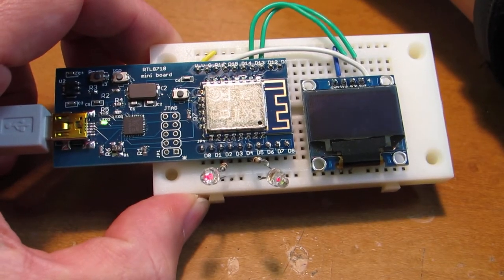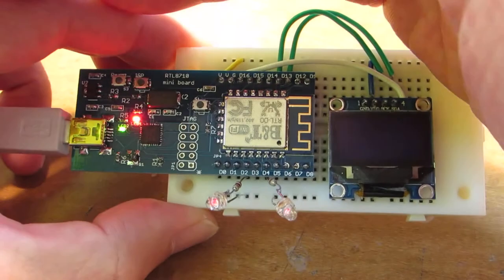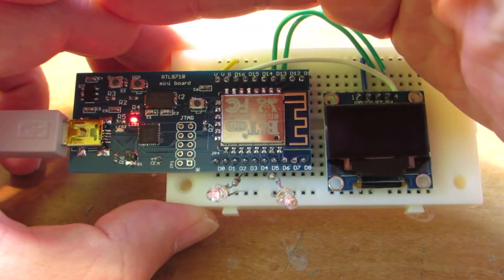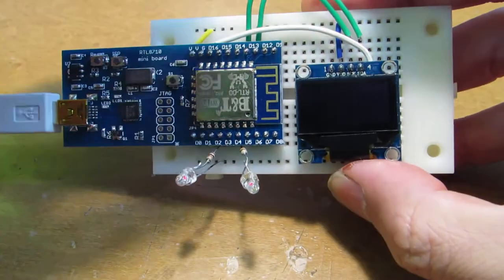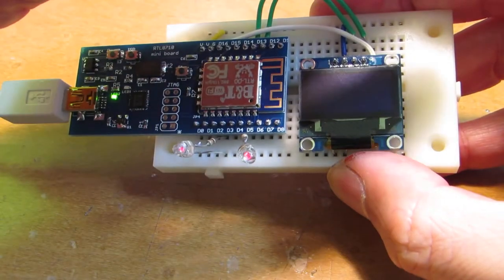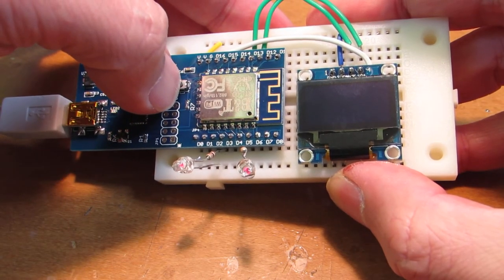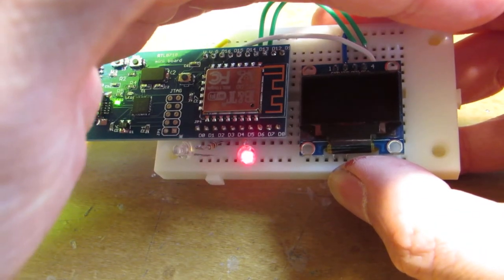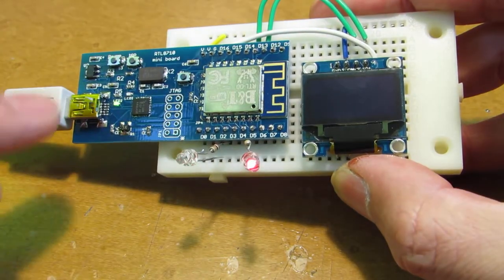It's the basis for the operation. As you see, during the uploading of the sketch, the LED will blink. And after it finishes, it turns off. Every time, just after uploading the sketch, we need to press the reset button of the RTL8710. Now it's blinking. This is uploaded through the USB interface.